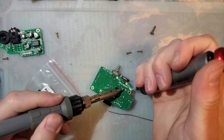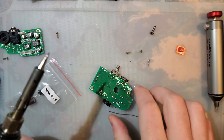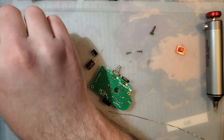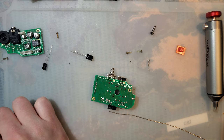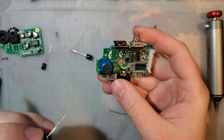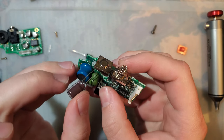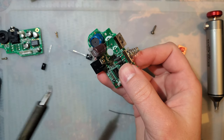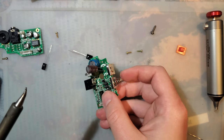What I should be using is my nice new helping hands. Right. New ones, so the 820 microfarad cap goes here. The stripe here indicates the negative, so just match up the stripe. Oh, I'll clean that up, that's weird. It's annoying.